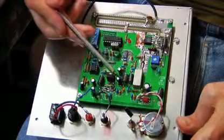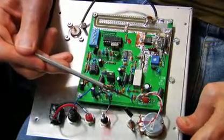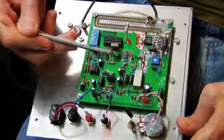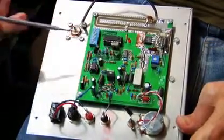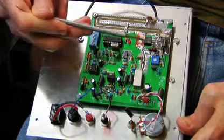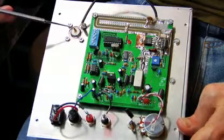The audio comes in at this point — this is your audio input from a standard RCA connector. Since the audio signal itself is a varying voltage, the varying voltage of the audio material will cause the oscillator to shift in frequency slightly one way or the other. That produces your actual FM signal — frequency modulation — and that's how we impart information to this carrier frequency, or the broadcast frequency that you've selected. Since the signal of the oscillator itself is very low, it's further amplified through a small amplifier here, through some circuitry, then finally goes to an output transistor, which boosts the power to the output level of 10 to 15 watts, fed through this coaxial cable to the output connector, which goes to your antenna.